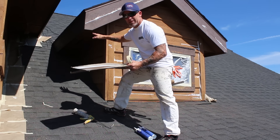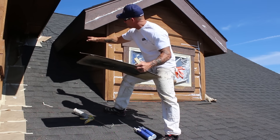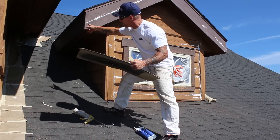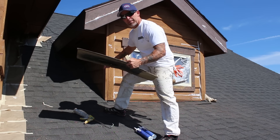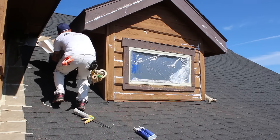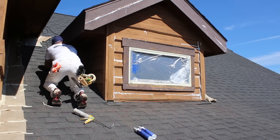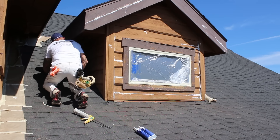So here I go, I'm going to show you how to mask it right now. Up here to begin this process, I've got a dormer and it's going to be the soffit and fascia running into the roof. I like taking a lot of cardboard shields and tucking them up inside there — it's a lot harder to get up inside there to mask, and cardboard shields tucked in around there prevent any overspray. Then I'm going to begin laying my masking down after that.